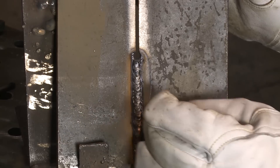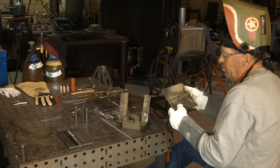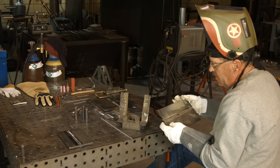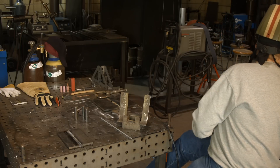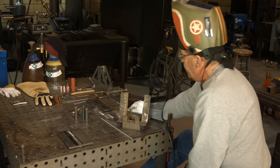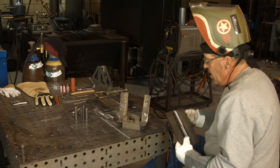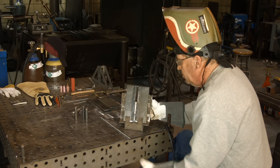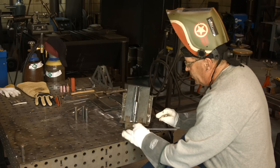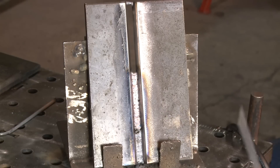It's all about breaking the edges down and getting the right amount of reinforcement and controlling it. On the strong 1/8" fit I'd thicken up the root face a little, and I wouldn't want to drop the amperage any lower than that. Everybody has a personal preference for fit. There are tolerances on weld procedure specifications — on root face it's plus or minus a sixteenth, amperage range is wide open, and gap tolerance is also plus or minus a sixteenth. Good to know if you're working on projects where you run into this kind of thing.